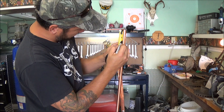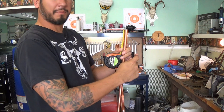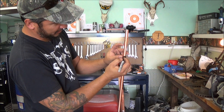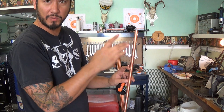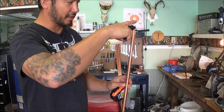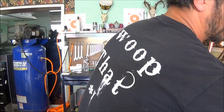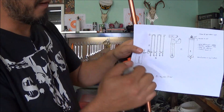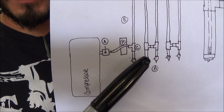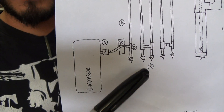What I'll do is mark the first one at two and a half inches, cut it, and then hold that one up to the rod to mark it again for the next one — and again for each one after that. That way I can be sure they're all the same size even if I cut the first one a sixteenth or so off. After that's done, I'm going to take the remainder and divide it by five — whatever that number is gives me the bottom pieces that come down to the ball valve so I can drain it periodically.